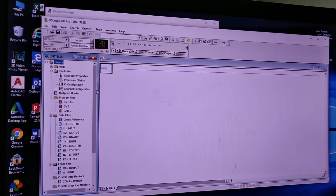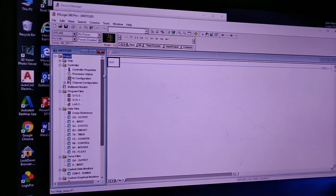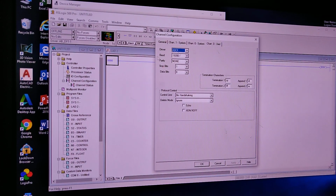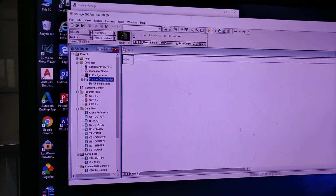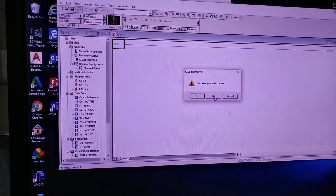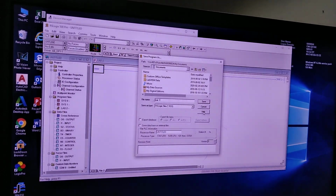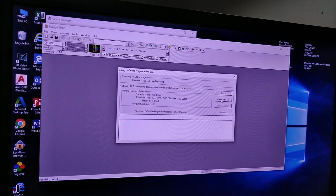Later on, when you select your CPU, you need to add your IO cards. So I'm gonna go to my IO card and channels, and then I'm gonna say open, and those are my channels, but it's not there. As you can see in the PLC, we have a lot of channels. So now I'm gonna try to go online, and then I have to save it. I would say yes, save it. I'm gonna call it test 1, and then save it. And now it's gonna create a new file.